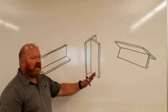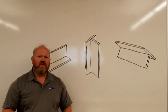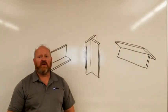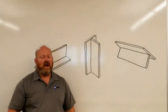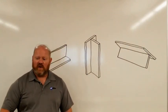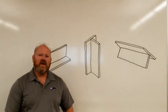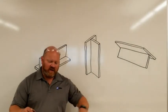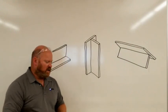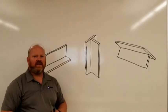For horizontal welds, a welding instructor once asked me: do you want to see where you're going or where you've been? I want to see where I'm going. Being right-handed, I'll always weld toward my body if possible — starting out here and welding in this direction. I want to see the front side of that nozzle. I don't really care what's going on behind me because I've already been there. On my fillet welds, being right-handed, I'll generally start on the right-hand side and work my way to the left.